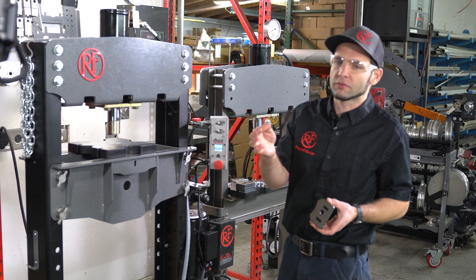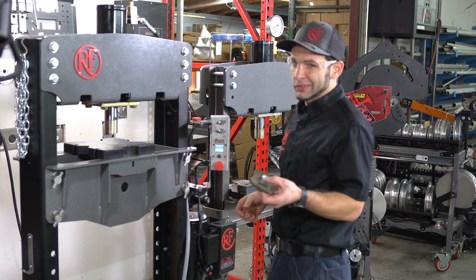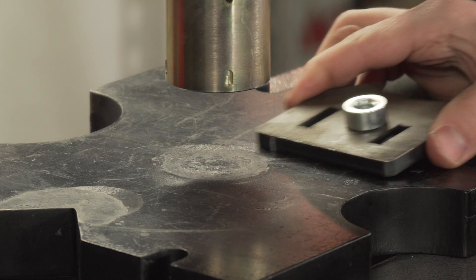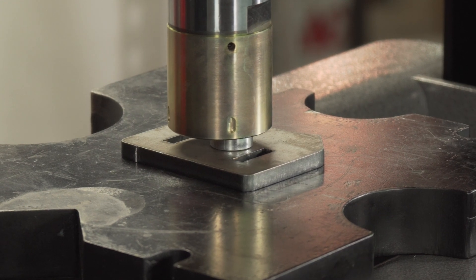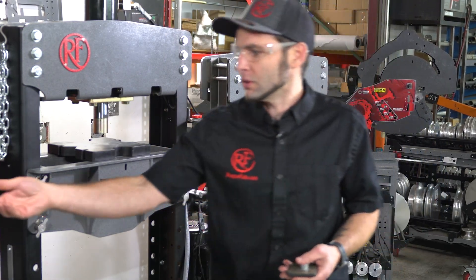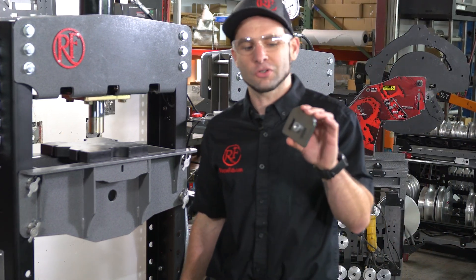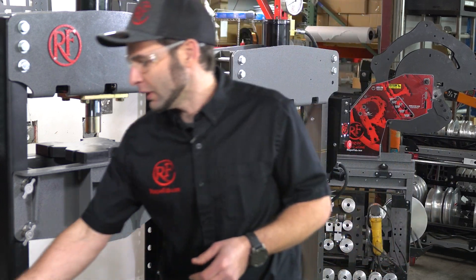We use a lot of PEMSERTs here — that's a name brand for a sheet metal nut. They're still called sheet metal nuts even when used in thick plate like this quarter-inch steel. This is a really large one: a half-13 thread. In our experience, those take a setting of 2.2 tons. With force control enabled, we just run it until it stops — no operator variation. What we're left with is an extremely clean threaded hole with the correct threads, extremely strong, with far more threads than you'd get by tapping a sheet metal part. It's great for plasma and laser cut holes since kerf isn't a factor, and the threads are fully machined and already plated.